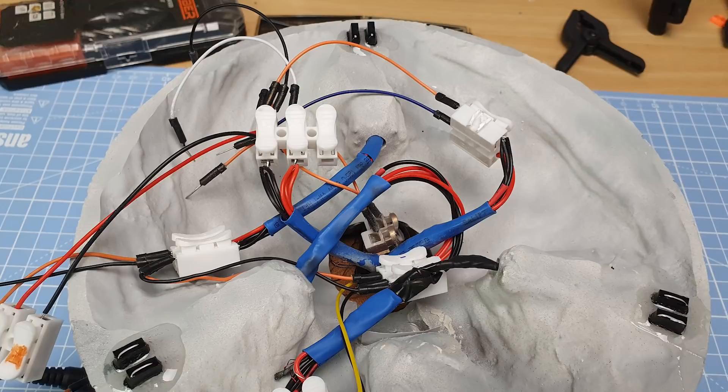Now this is where you come to the nightmare builds — I'm sure all modelers go through this. Everything seems to be going to plan and then suddenly something happens. When I was panning along the legs, one of the legs was off — then suddenly the lights came on. I had a loose connection somewhere I just couldn't find. I thought it was the power supply, then the earth — it wasn't either. It got to a point where I could just stroke one of the legs and the lights would come on and off. And I had already fitted those legs — they were already glued in with resin.